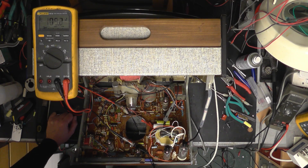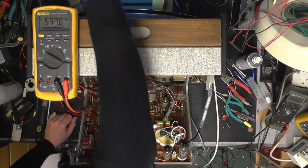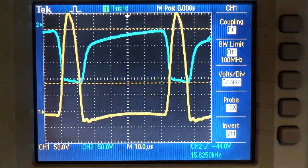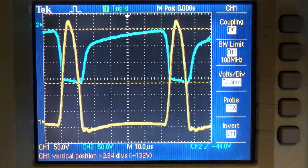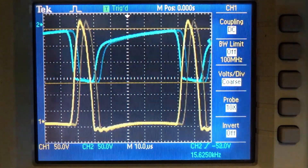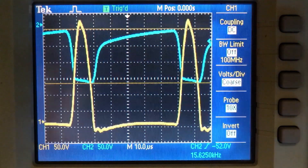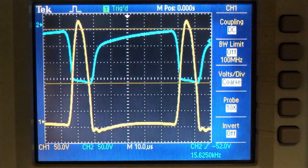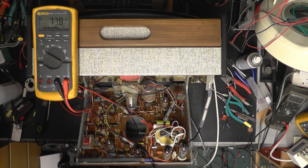Picture is now coming up. Adjusting the oscilloscope trigger. Width is there — adjusted brightness on the set; it's not really changing the width feedback signal much. Boost voltage is now at 737 volts. It's cold in here this evening so the fault may take a number of minutes to occur — I'll fast forward through the waiting.